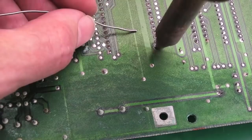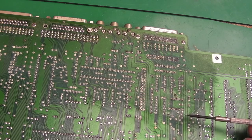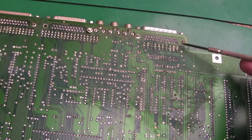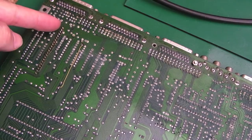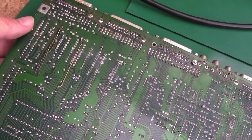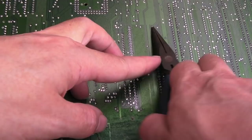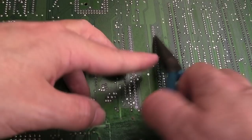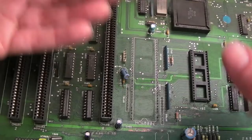I didn't realize this, but oh my god — look at the back end of the board: super dirty and corroded. The alkaline has got on the back end as well. There's also an interesting thing going on here — it looks like someone swapped out the hybrid at some point, and there's a wire here that might be a factory mod. I've removed most of the solder now, so I'm doing my usual thing of grabbing two or three pins and pivoting to snap them off. There we go — out. Some pins around here are a bit green.